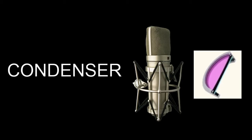The drawback with a condenser mic is that it needs external power to be able to create this. And so that can either be in the form of a battery, or more often than not, it's something called phantom power, which comes from the amplifier or the mixing desk or a DI box, which provides the power to the microphone. So don't think you can go out and get a condenser mic and then plug it into an amp, because it won't always work if it hasn't got phantom power.